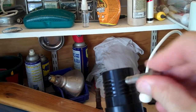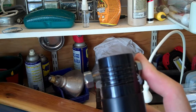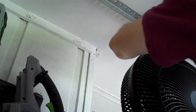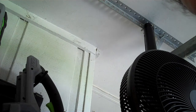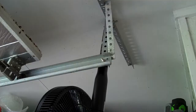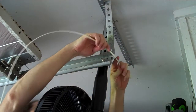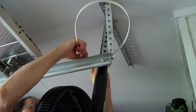This is a 5/16 by 18 bolt, which fits the holes in my bracket very nicely, and a nut — that's all I'm going to use to hold this thing up, other than a couple of zip ties for stabilization. Now this is a piece of plastic, so I don't want to tighten it too tightly. I'm definitely going to put a little bit of Loctite thread locker on the back of this because this fan is going to be vibrating and I don't want it vibrating that nut off. This is holding all the weight but it still wiggles because it's only one point of contact, so I'm going to use a pretty serious zip tie around the bottom here to give us some stability.